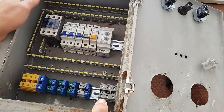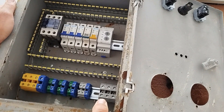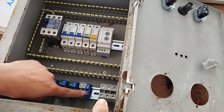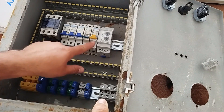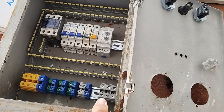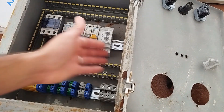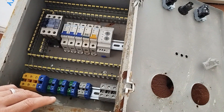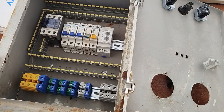These three pairs of terminals you see are single-phase outputs that connect to this single-phase miniature switch, and these are also two single-phase outputs that share a common neutral and connect to this miniature switch. Additionally, this electrical panel includes a socket on its body, which we can use to extract single-phase power in emergency situations. It connects to this 25-amp miniature switch.